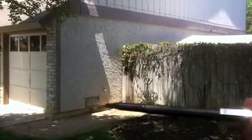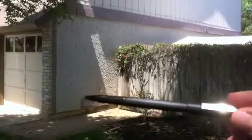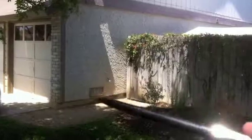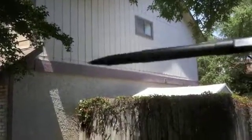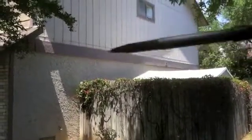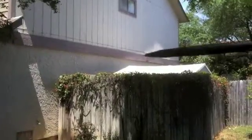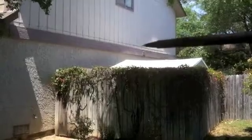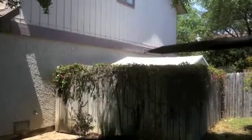let's replace this 8x16 vent and then trim it out in Hardie, and that should be a good 1x2 Hardie trim out there. So we're doing the siding overlay in the Sierra 8-inch vertical siding, and then doing the stucco paint, doing a facing on the band board. You've got a little vent right here too that we need to replace with a new dryer vent. So let's check the ducting behind that dryer vent and replace it after we put the new Hardie facing on this beam. And the beam wraps around to the back of the house too that we're going to be doing.